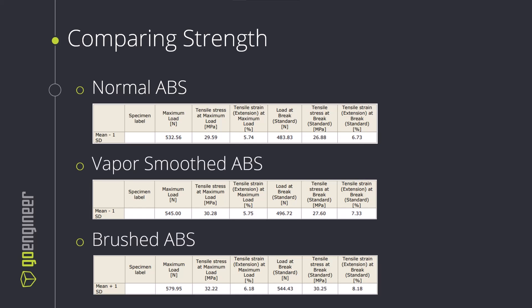I think it's also safe to say that if we expose the part to too much acetone, we could eventually decrease that bonding area and start to destroy our part and weaken its overall strength. Though we didn't see a significant increase in strength, vapor smoothing is most often used to increase the visuals or optics of a part. So it's nice to know that in accomplishing those goals, we're not sacrificing any of our part's strength or functionality.